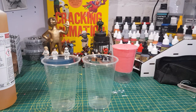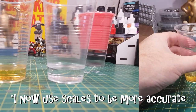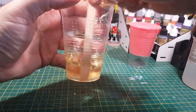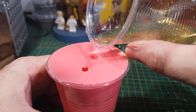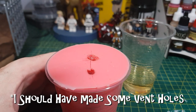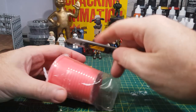I'm using the two-part liquid plastic which I've used before, and again this is from Amazon. It's mixed to a ratio of one to one, which just makes things so much easier. Give it a good stir to mix it all together, then slowly pour into the mold. Every now and then I'll give it a little tap and a shake to help the mix reach all the ends of the piece and get air bubbles up to the top. This is then left for 30 minutes to set.